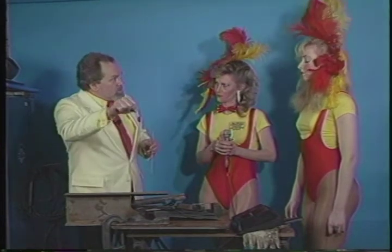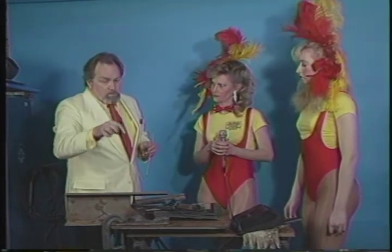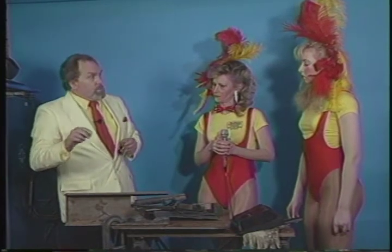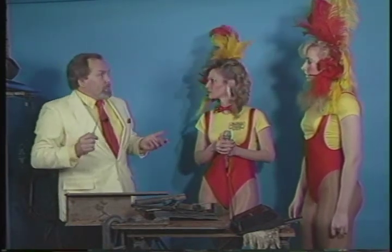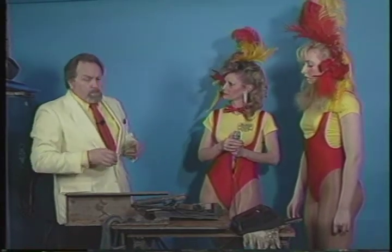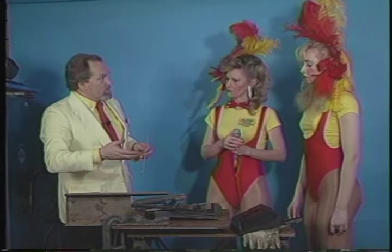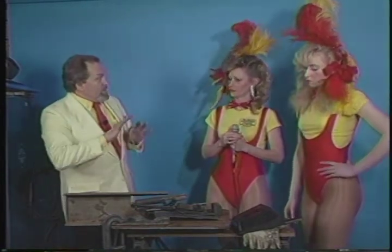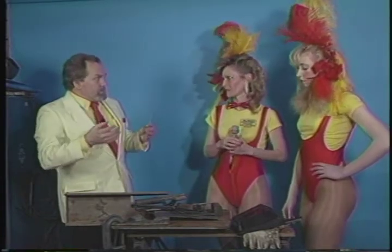I'm sure you can understand as you're welding along, and again, the important thing is the weld puddle all the time, and let me emphasize that point. This stick welder doesn't do anything different, nothing different at all than the oxyacetylene welder did. In other words, it puddles the metal and filler rod goes in. That's it. It just does it differently. It does exactly the same thing.